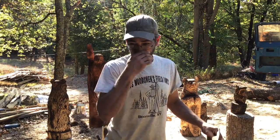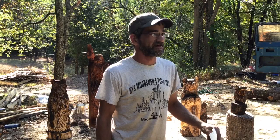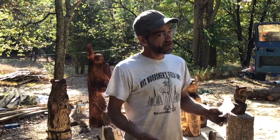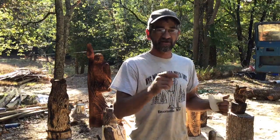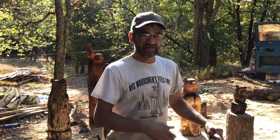I want to be able to get one so this way if I accidentally leave it in the can and it gets hard or something like that, I don't feel like I just raided my bank account for another paintbrush. Dollar General's got pretty decent brushes for not a lot of money. And I'll say the quality's sometimes decent, sometimes terrible. Sometimes the head gets real loose on them, so I'll just take a brad, like a little finishing nail, and I'll drive it right through a couple places and bend them over. That way it holds everything together.